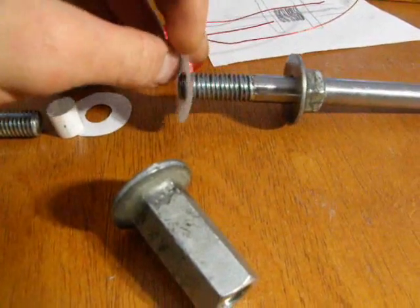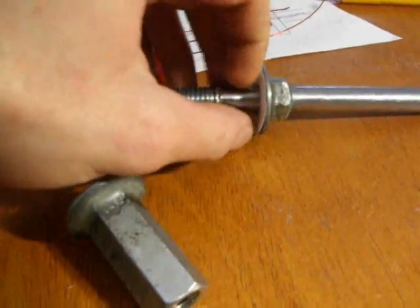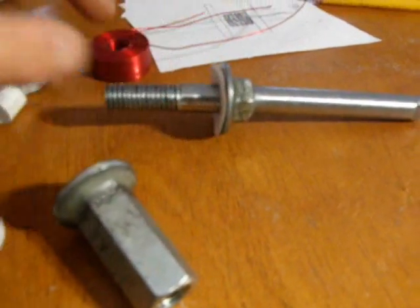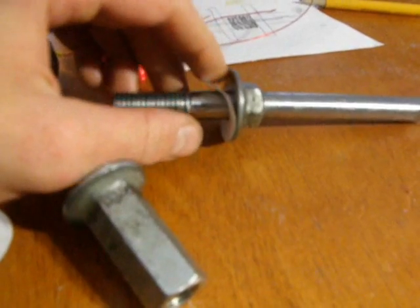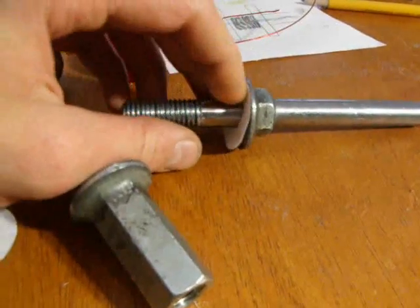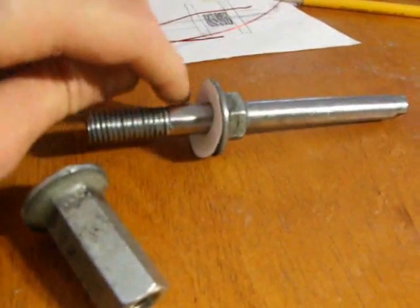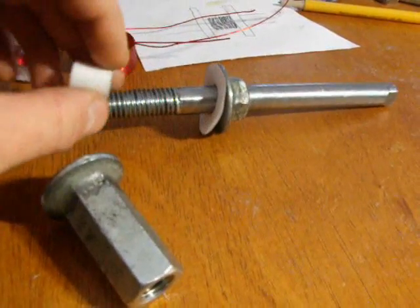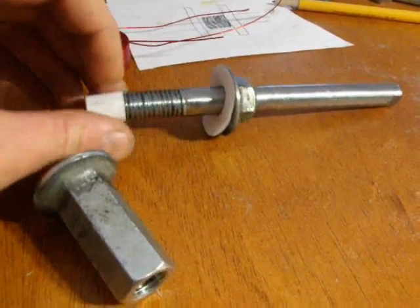Here's how I assemble the device for winding. I put one ring here. There's plastic insulation between the rings and the coil, so the paper will stick to the coil but the coil will not stick to the machine. To protect the middle part, which is bare metal, I use a ring with plastic around it.